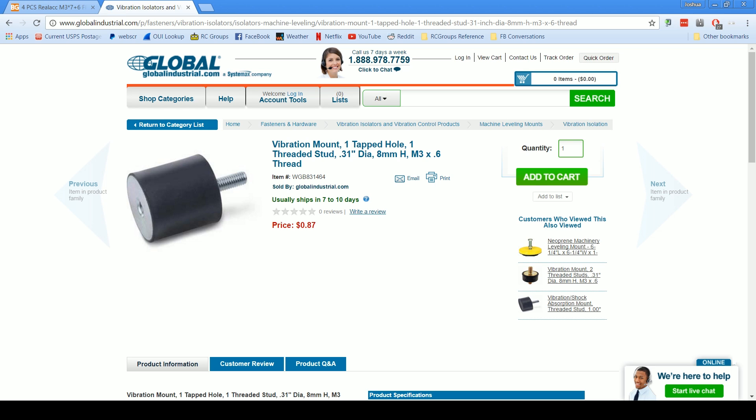So what are the rest of us supposed to do? This is what I think is the best way to vibration isolate your flight controller. What we're looking at here is a vibration isolation mount. It's got a tapped hole on one side and a screw on the other side — basically it replaces the nylon standoff that you'd normally use to mount your flight controller. The great thing is that it completely isolates the flight controller from the copter's vibrations. There is no solid surface, no screw, nothing passing through — it's just the rubber. I've been using these on my copter for several months and they work great. I even used them to mount the Revolt V1 on my Racelet 1 copter when I accidentally blew up the Revolt V2 board by putting voltage where it shouldn't have been.